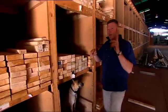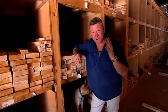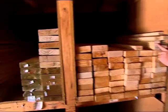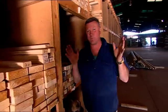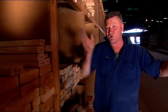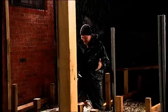Now when you're building with timber you've got to be aware that there is going to be some wastage, but what you need to do is minimize that and try to minimize the workload as well. Timber comes in 300 mil increments — you've got a 300, a 1800 and it all goes up by 300 mil. Plan your job to timber lengths. For example, the designer wanted to do the retaining wall with timber sleepers four meters long, but the longest sleeper we can get is about three meters, so to avoid the join and extra work, we made him reduce that to three meters to suit our timber lengths — less wastage and less time.